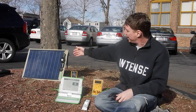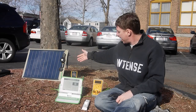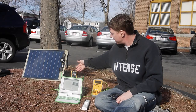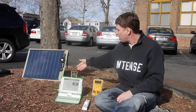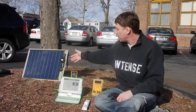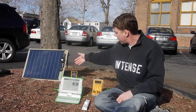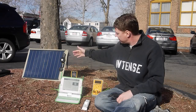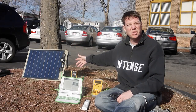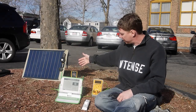What we have here is the standard OLPC 10-watt solar panel and our irradiance meter, which currently is measuring around 700 watts per meter squared, which means this 10-watt panel will be producing approximately 7 watts. Now it's up to 800. With the Boston winter here, it's been fluctuating in the 500 to 1000 range — right now it'll be full output of 10 watts.